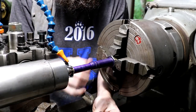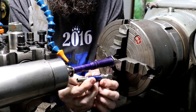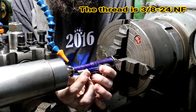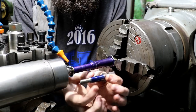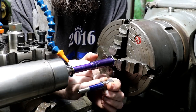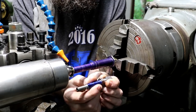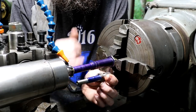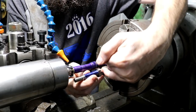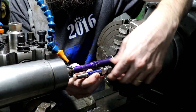All right, so I've got my bolt in the lathe, and I've just roughly laid it out with some Dykem. Now, the first thing we're going to do is turn this major thread diameter down on the back. Then I'm going to come in, and instead of turning the taper, I'm going to turn it all to one diameter, slightly larger than the large side of this taper. That way I'll have something good to grip on when I flip this in the chuck. I'm going to skip this feature here, come in, and turn our 9/16 diameter down for our thread on the front.